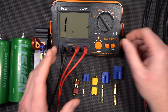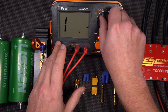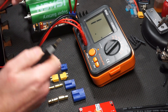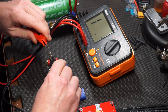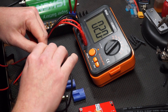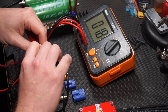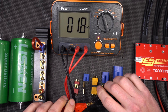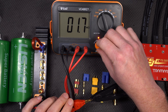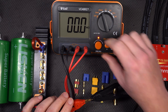There is a 20 milli-ohm range on this meter, but that can kind of drive you a little bit crazy, so let's stick with the 200 milli-ohm range. This process does take a little bit of effort and some checking back and forth, because we are talking about resistances that are incredibly minute and this thing will drift over time, so you have to make sure you zero it out every time. That seems like a pretty solid 1.8 milli-ohms — let's zero that out.